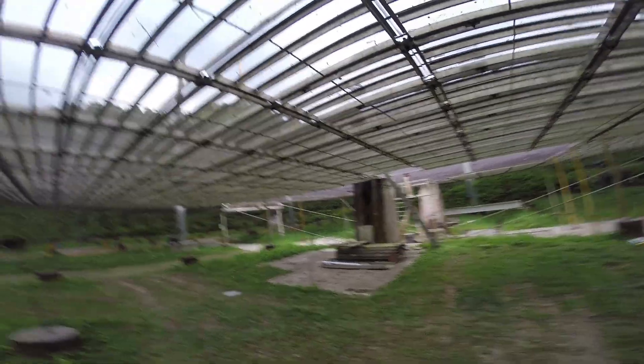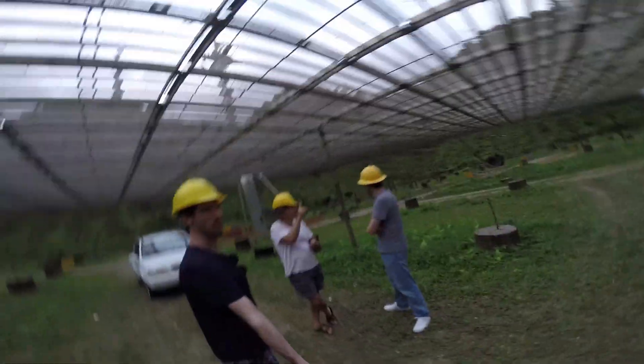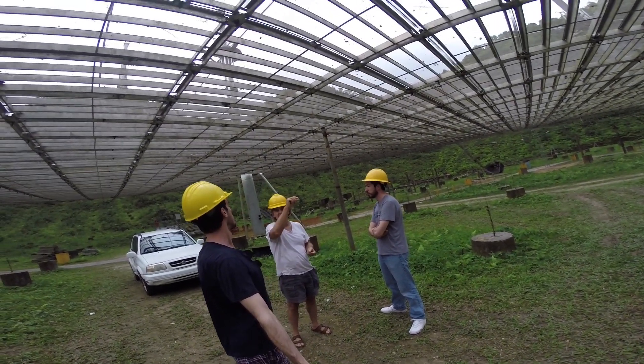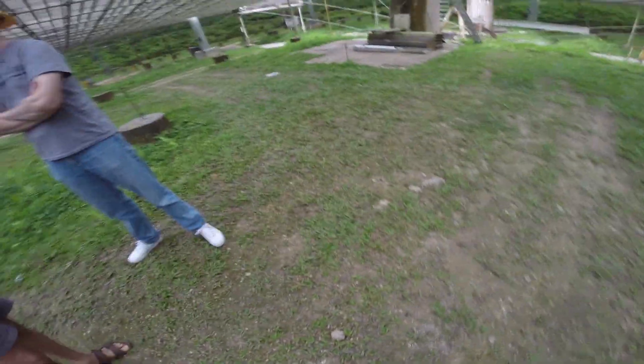The problem with the line feed, though, is that they're narrow band. The wave comes in and at the edge of the dish it focuses at the bottom of the line feed, and as you come down it moves up the line feed. When you're right underneath it, it focuses at the top. Everything is in phase but it's spatially extended by 90 feet. The problem is how do you bring this thing to a point and remain in phase? Because that's what the line feed does, but it's a narrow band object.